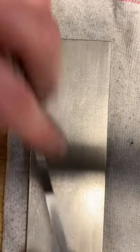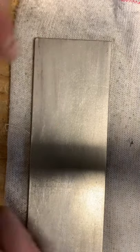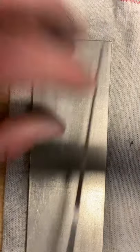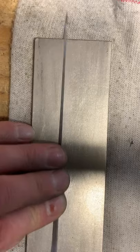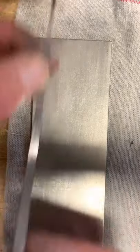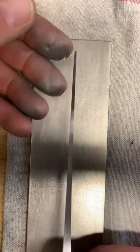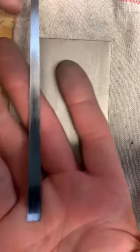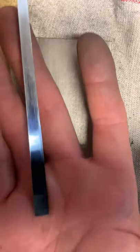I'm not doing the entire reed - this back area right here will be all tail and it's going to get cut off. But for handling purposes it's nice. I like to cut my steel eight inches long for working with, because you have a nice handle. Because if I was just working with a little piece - exactly what I needed for the harp - it'd be difficult to hold. Here I can hold it in my hand, and then I grind the corners off just so it's not sharp on my hand.